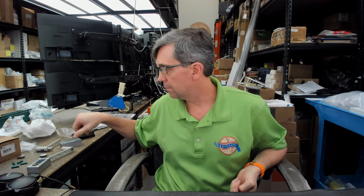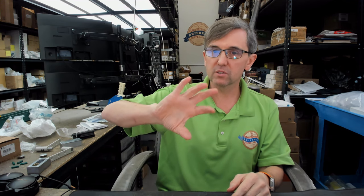I would think that you could easily make a service panel situation. You could absolutely have some sort of access where your set screw is reached through there. And that's the short version of the installation procedure. Once you get the door tipped up in place, well, actually, it's almost complete. Door is tipped in place, you're secured top and bottom. And what you're going to want to do is seat the set screws.